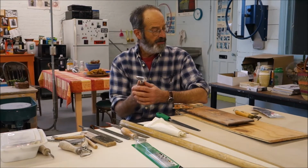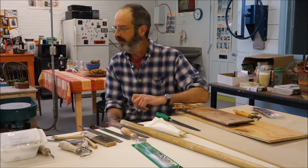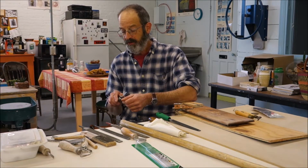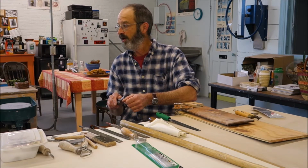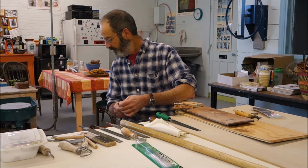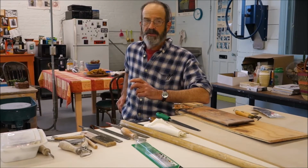So it's sort of, the material's begun to be sharpened to begin with, but these are not sharp. Okay, so another thing about sharpening: how do you test things are sharp? You see people go like this, well, yeah, that's obviously not the great way to do it. If it's dull, it'll skid across your nail. Like, this is not that sharp, I'm ashamed to say. If it's really sharp, you'll feel it catch on your finger, and that's the safest way to tell if you make a little cut. It won't even cut. You'll just feel it grab a little bit. Well, we'll see if we can get one of these sharp enough to do that. I should sharpen this thing. But yeah, that's the safest way to test any kind of sharpening.